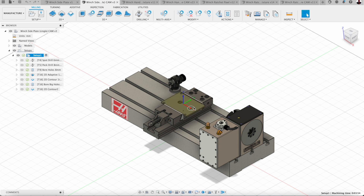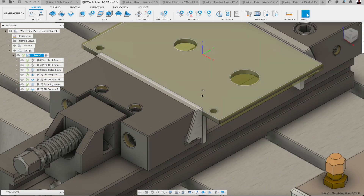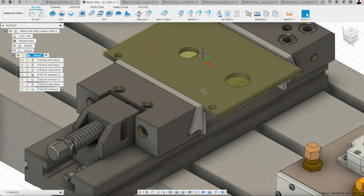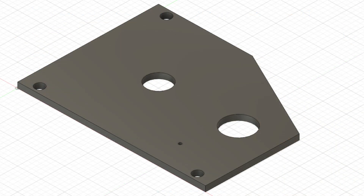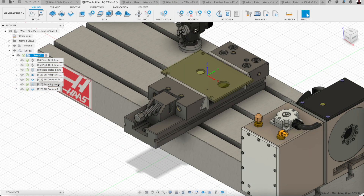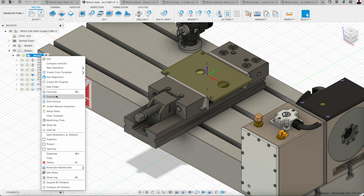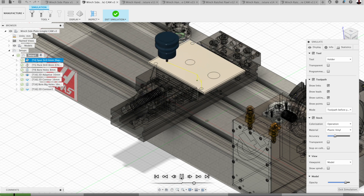With my steel plates, I'll be machining one at a time. You'll see that I'll leave a witness mark on this plate because only one of these plates needs to be drilled and reamed. I put a little spot drill hole there for Maddie so he can pick it up. There's some other post-machining he'll have to do — he'll have to machine an angle along here. I didn't model that because it's just going to give me grief with the CAM, so I kept it as a rectangle. This is really simple, just 2D stuff today.